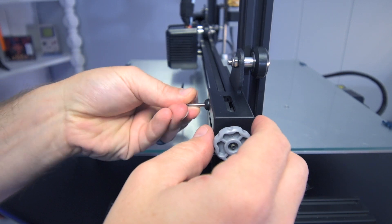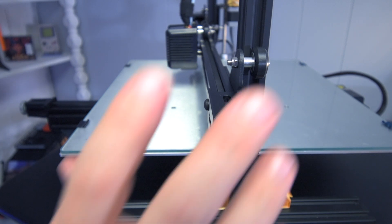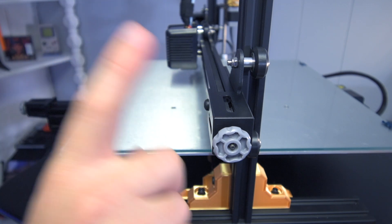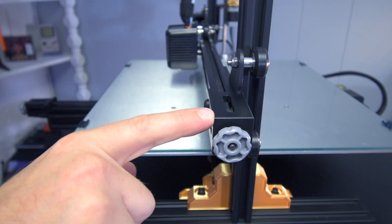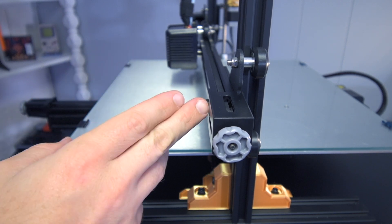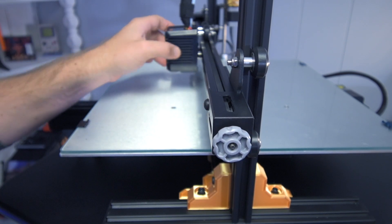What a simple little fix. I think this is a problem on quite a few machines, because I have two of the same brand and one of a different brand with the same issue. So definitely check your tensioners, especially if they're plastic like this, and make sure that this bolt is not bottomed out. A simple washer fixes this entirely, and now this is running nice and smooth.